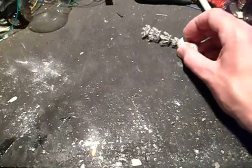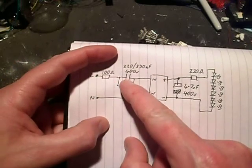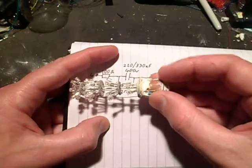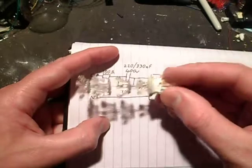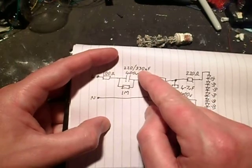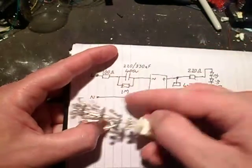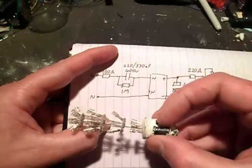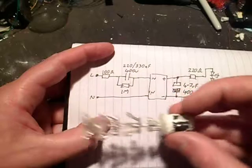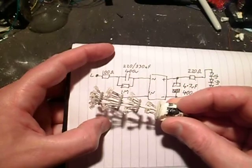The circuit is very straightforward — exactly what I was expecting. It's got a 100 ohm inrush current limiting resistor and a capacitor. I can't actually measure the value of that capacitor because I don't have a capacitance meter with me right now, but it was quite hard to get the resin off intact, so I'm guessing it's either 220 or 330 nanofarad — probably 330 — rated at 400 volts. There's a one megaohm resistor soldered across the back of it as a discharge resistor, and a tiny surface-mount bridge rectifier which converts the limited AC into DC.